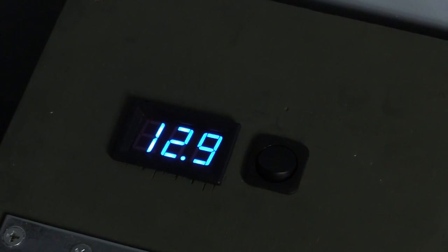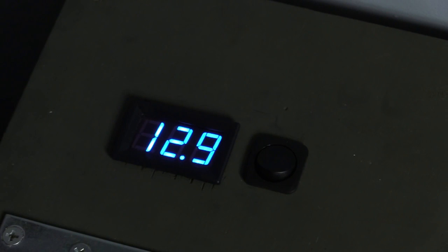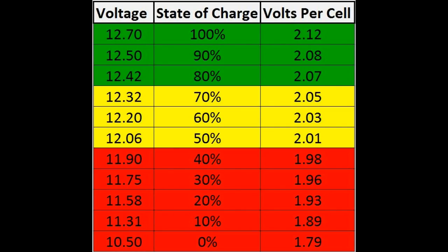Also, on my battery box, I've installed a voltmeter. When the batteries are neither being charged or under load, the meter will tell you the approximate charge state of the batteries. I got this simple meter off of Amazon, and there's a link below in the description. It's wired into the positive and negative terminals with a fuse on the positive leg. There's a link below to a chart that will show you how to translate the battery voltage to the percentage that's charged.